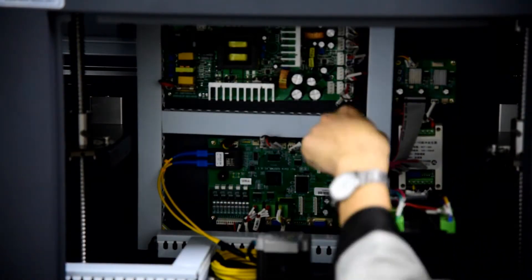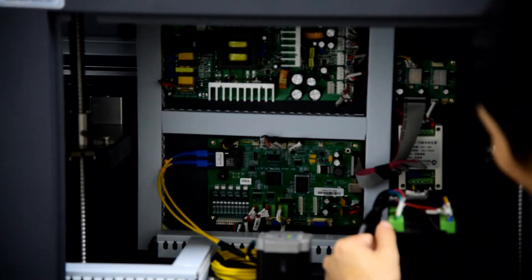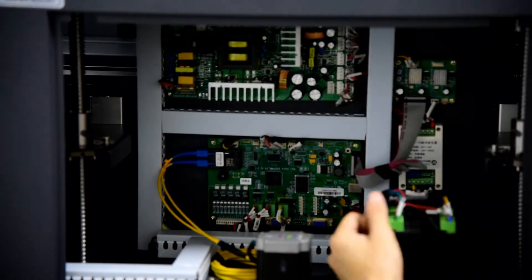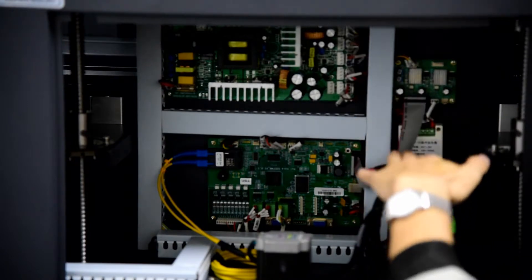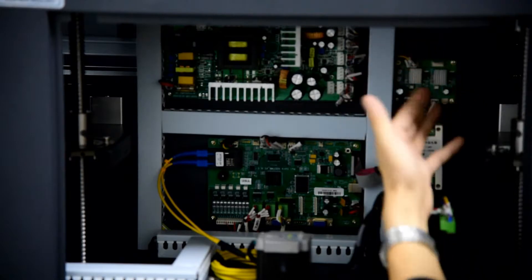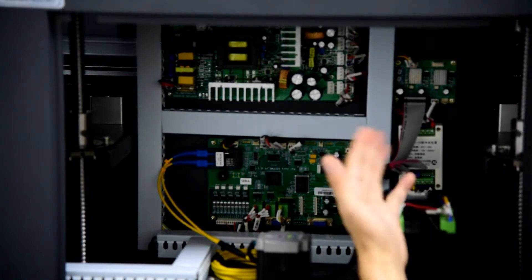There is a power supply box that supplies different voltages — 42V, 36V, 24V, 12V — for different electronic parts. You can also see two ball screws which move the table with high precision. Focus newest technology is built at industrial level — we use a high-configuration ball screw so the table moves without any horizontal or vertical bending. There are also two more ball screws on the other side of the machine. The left side panel is mostly for the electronic system.